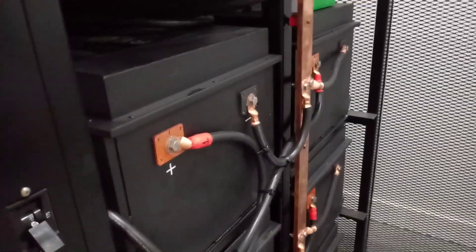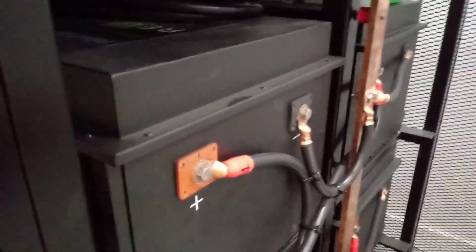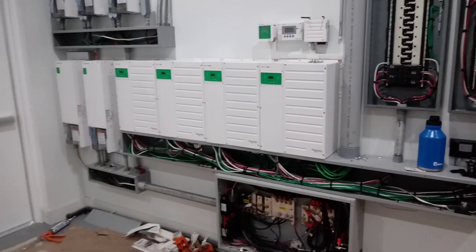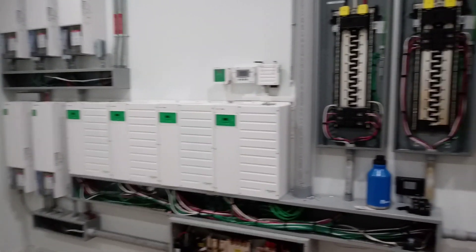We can do 1000 amps on that wire, we can do 1000 amps on this bus, and we can do 1000 amps at the battery combiner, so we have to limit everything to 1000 amps on the inverter and charge controller side. On the battery side, these batteries can do 225 amps each but we're limiting them to 175 each because we've got six of them. It's perfectly sized for what the system can actually draw at max power and what it can push back into the batteries with the solar.